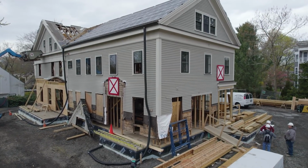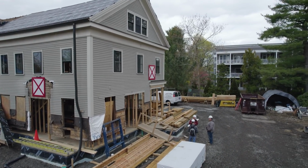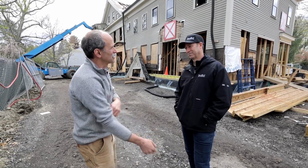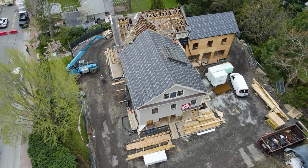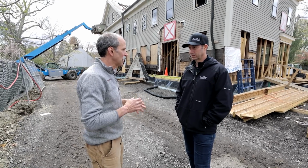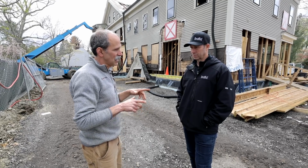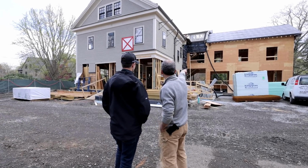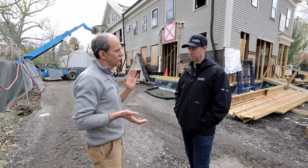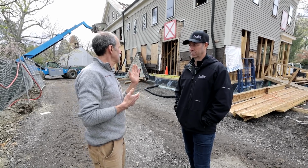And I'm assuming that there's a fair amount of smart framing going on here to try and get a 140-year-old house onto a new foundation. So what we did is before we lifted the building and before we inserted the steel in the building, we had to make a very careful survey of what the existing conditions were. A lot of that was understanding not only the geometry of the footprint, but the geometry of the outside size and shape of the building as we went up, because what we were trying to do was, any existing framing that had the potential for being absorbed inside the new frame, we had to know: is the wall leaning out? Is it leaning in?